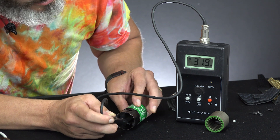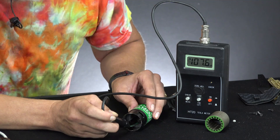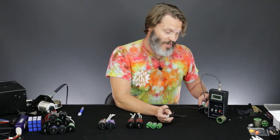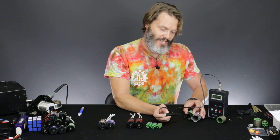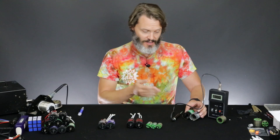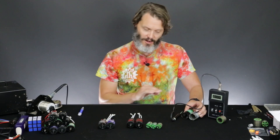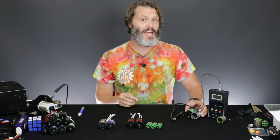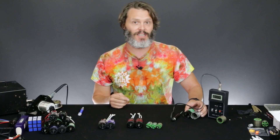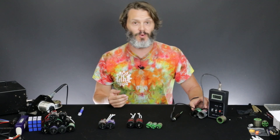This one drops off a little more at the side — but right at the edge, it's still above 100 milli Tesla. And that is why you can't look at looks or price alone for the performance of a motor. We really tried our best to make them quality all the way around, and a big part of that is having a nice magnet — not just the cheapest magnet in a low cost motor, but a magnet that will do what we want it to do: really nice, good on torque delivery, torque dense, and good for your price.